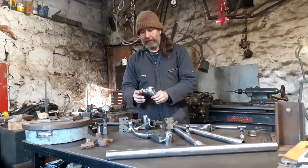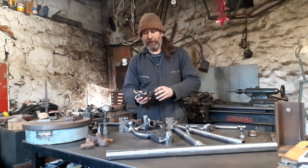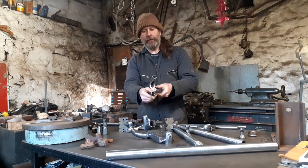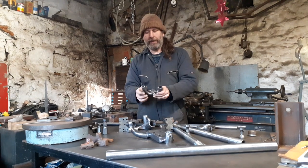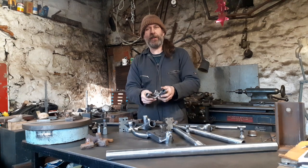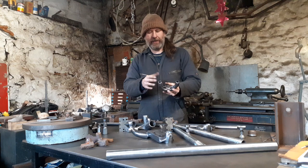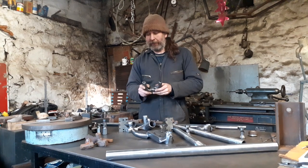Basically, by way of milling machine, drills, lathes, and a little bit of grinder, you shape them up, fettle them up, machine all the tube ways. It's quite close tolerance — I like about four or five thou clearance on mine, because I actually use silver solder to braze them together rather than braze, because braze is a high temperature and the cast iron doesn't like it so much. So it's got to be close and fit to get the strength.